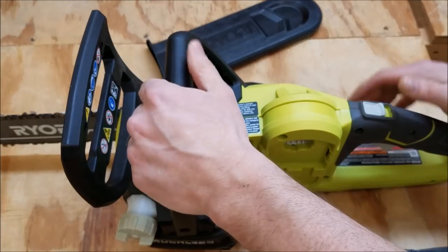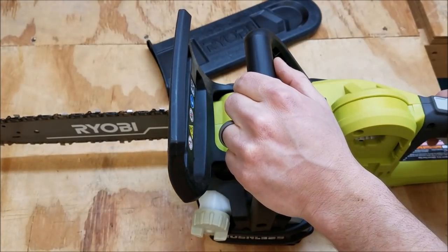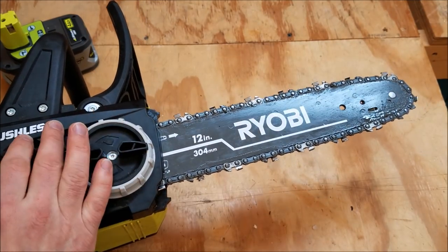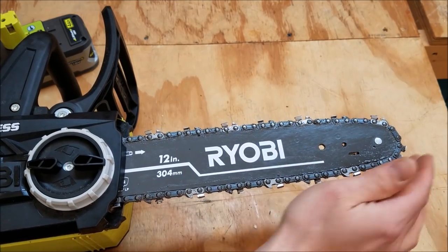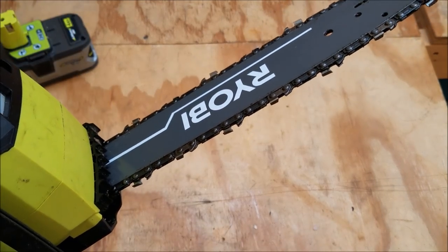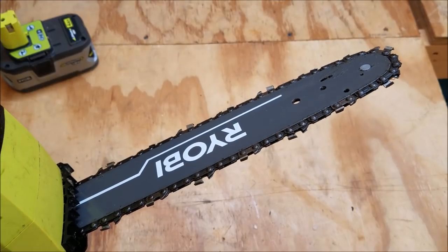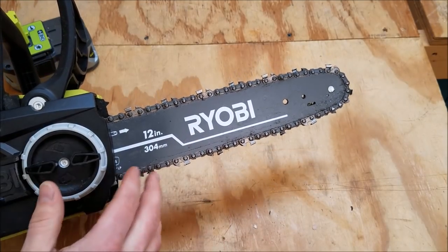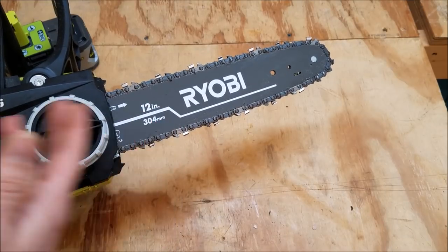That's pretty standard layout for a chainsaw. It is a right-handed tool — you are not supposed to use it left-handed for safety reasons because you'd be reaching over the line of the bar, and you don't want to be doing that in case of kickback. Ryobi bumped up to a 12 inch bar over the older 10 inch bar. With that you get about 10 and a quarter inches of actual cutting length where you have exposed chain. You've got the pawls here for bracing against your log. Anything bigger than 10 and a quarter inches you won't be able to cut in one pass. I managed a trunk that was 8 inches in one direction and 10 inches in the other, and I cut it in the 8 inch direction since that's the way I wanted the tree to fall — no problems.